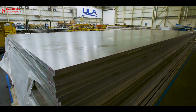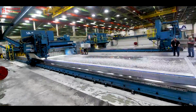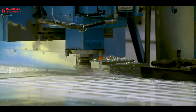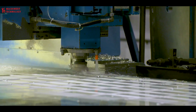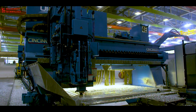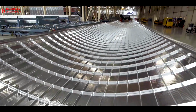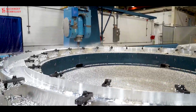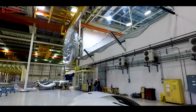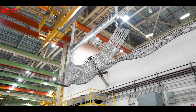Vulcan Centaur production begins with aluminum sheets expertly machined to remove more than 2/3 of the weight, resulting in structurally strong yet lightweight orthogrid panels that form Vulcan's propellant tanks. The panels are then bump pressed to form the curves required to complete aluminum domes. Panels and other structures that form Vulcan's propellant tanks are first cleaned and attached to a smooth, even surface, and then anodized to harden and prevent corrosion, following an ultrasonic inspection of completed panels.